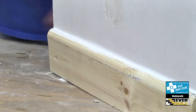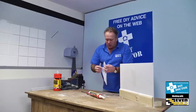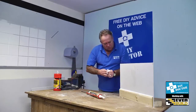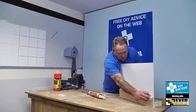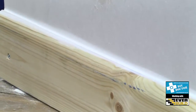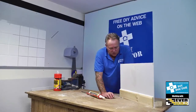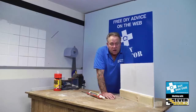Knowing that it can be over-painted, and using EverBuild's Wonder Wipes — the solvent-free version, which is brilliant — I can clean my hands and show you that it gives a very neat joint between skirting board, architrave and wall, or any other joints you want to fill that will remain flexible. An hour later you can paint it.